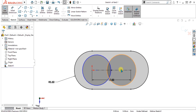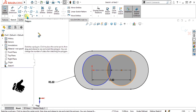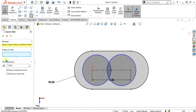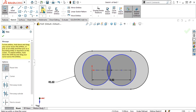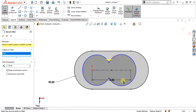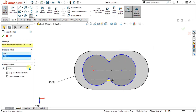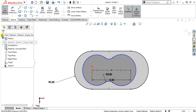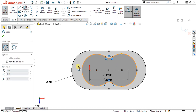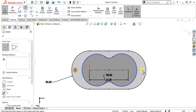You can make any shape. I am making this shape for better understanding of the forming tools and the parameters used in forming tools like stopping face and face removal. Now simply trim these entities, select the fillet command, select this circle and this circle and make the fillet to make them smooth. Now simply drag it to the center and make the two holes like this.